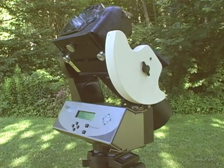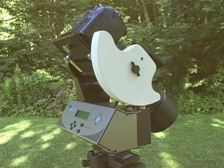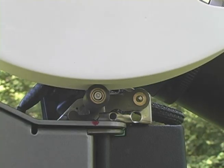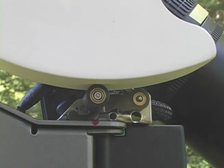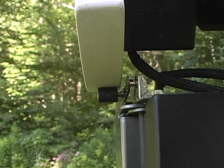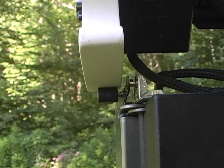So for scenes with objects close to the camera, I'll have to use that Nikkor 55 to 200 mm AFS lens. I was lucky enough to find a roller with good bearings in it, and so I suspect this setup does not increase the load on the tilt motor, and might even reduce it. The major drawback of this setup is that it is more or less specific to one position of the camera tray on the tilt motor plate.